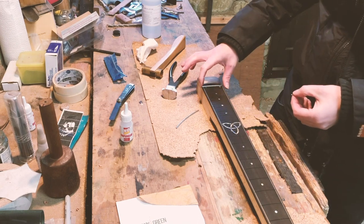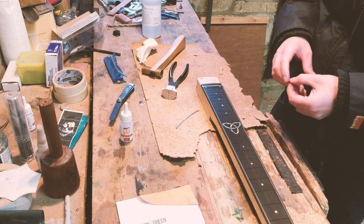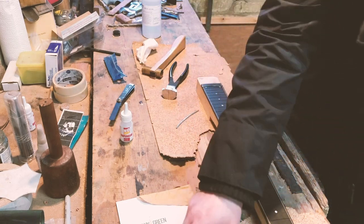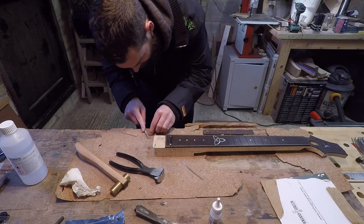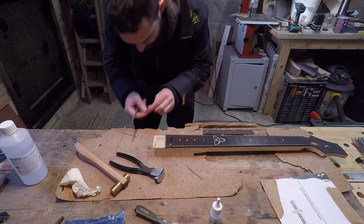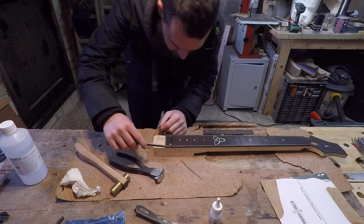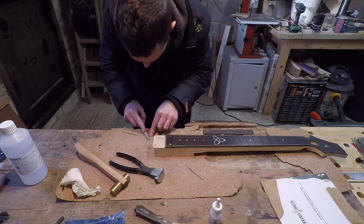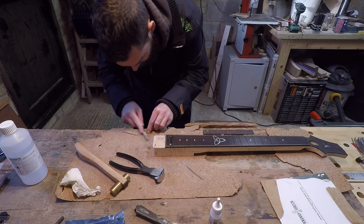Now then, when I'm cutting the tangs off, I'm cutting the tangs so that there really is barely any gap between the insides of the binding. Because when the fret flattens out, it changes the length of the fret by such a minute fraction of a millimeter that you haven't got to worry about it pushing the binding out. And what I want is for as much of the fret as possible to have tang to hold it in, especially at these ends here, because otherwise the very end of the fret lifts at the end, and that creates more levelling, and also you get a gap here and you always end up with a sharp edge, which is not good for comfort.